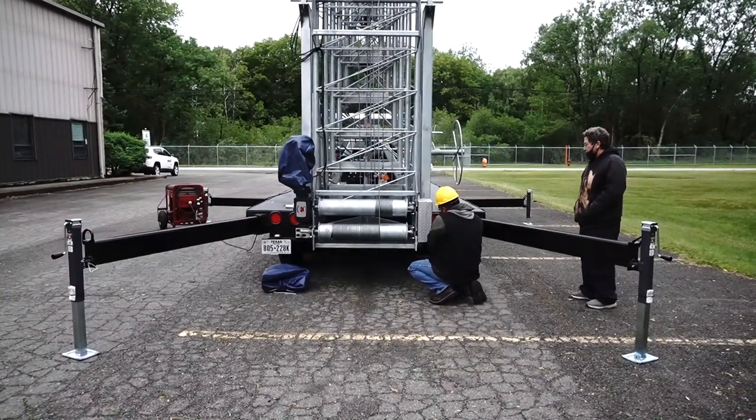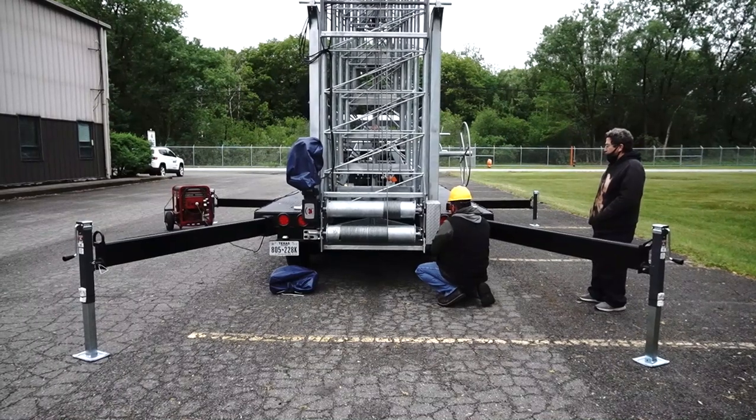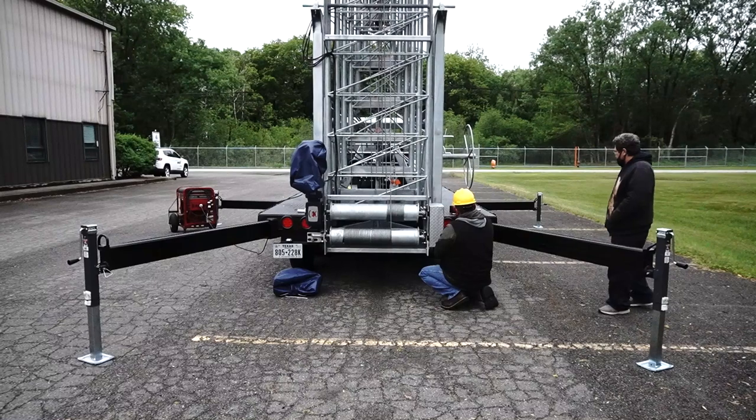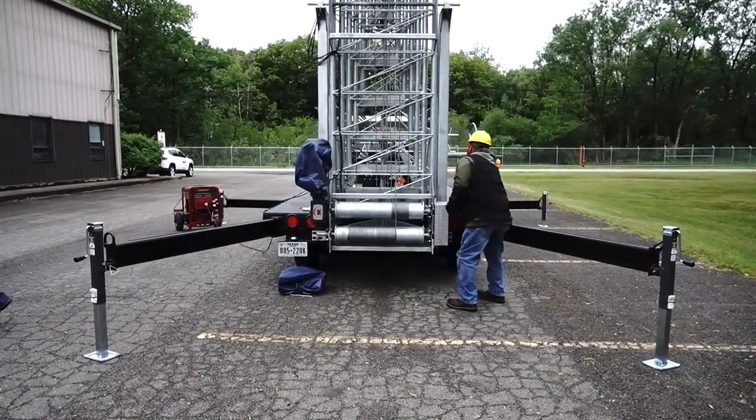It's got some initial startup current. You can hear it in the generator, but when it's running, it's probably only drawing 8 amps or so, 7. I doubt it's drawing more once the motor's up to speed. That initial current draw is probably the problem, popping breakers.